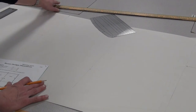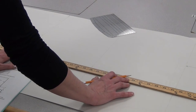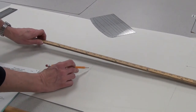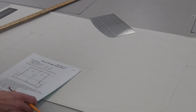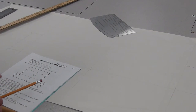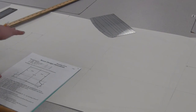Take the metre stick and join eight to ten. Hopefully six will intersect right in the middle, but if it doesn't, just move six so it's exactly at that intersection. To recap: step five was squaring a line at three-to-seven; step six was squaring it down 15 centimetres; step seven was four-to-nine, squaring it across 10 centimetres; and step eight was squaring it down 15 centimetres and then joining eight to six to ten.